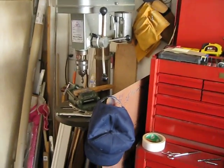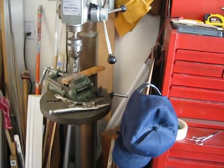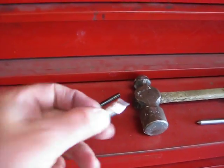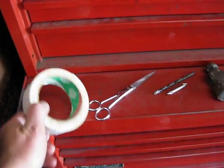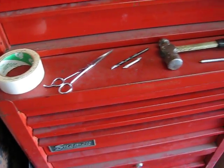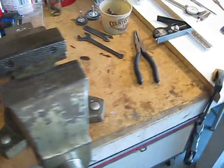The junk bench — so many little parts. And a standing drill press. Got to have a drill press, otherwise you can't drill accurately. A couple of tricks on the drill press to get your holes centered: have one of these nice little centering drills, otherwise the drill seems to wander around. Good center punching, double stick tape — carpet tape — comes real handy when you're transferring holes from one piece to another. Put a couple pieces of tape, use transfer punches, center punch, center drill, and there you go. You don't have any problem having to egg out holes.